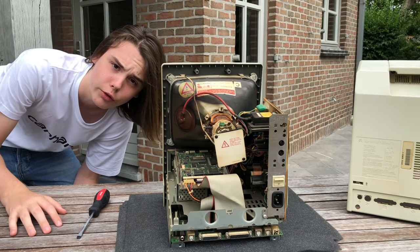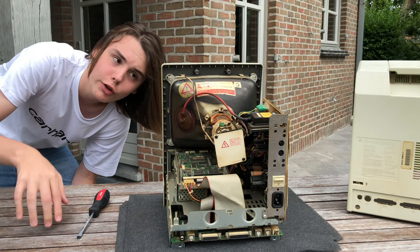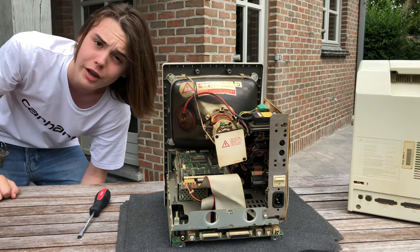So sorry for the background noise, I'm actually in my backyard right now, so yeah. So first thing you need to do before working on one of these is discharge the CRT, so I'll go ahead and do that now.